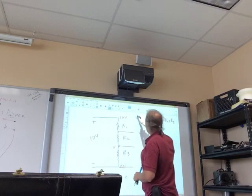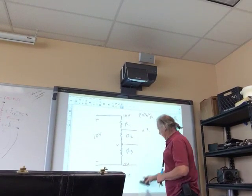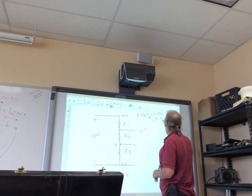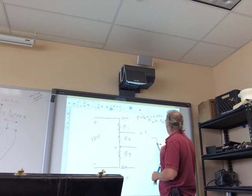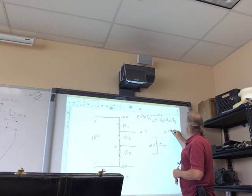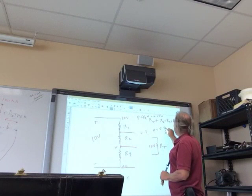and I said the power is 1/4 watt, which is 0.25, right? So these actually look like RT, so I could actually redraw this as RT with 10 volts, and I told you that RT was 1/4 watt, 0.25 watts. So what does that tell me now? Well, I know that P equals what? I times E? Yeah. Okay.